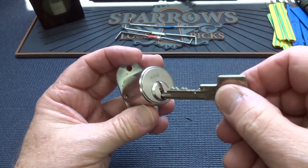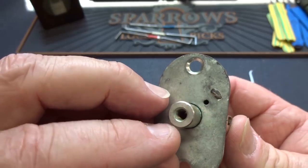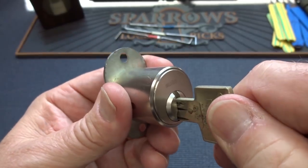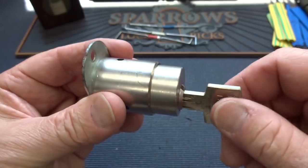It works kind of neat. Let's slide it in there and let me describe what's going to happen first. I'm only going to rotate this about an eighth of a turn, and the locking bar is actually screwed into the back of this lock. So when I turn this an eighth of a turn, the front of the lock will slide out away from the front of the cabinet, pulling that locking bar out of position and allowing you to get in.